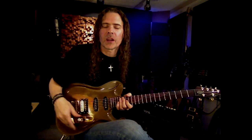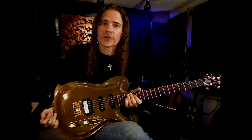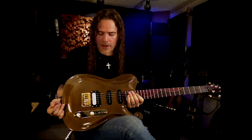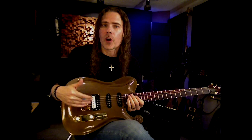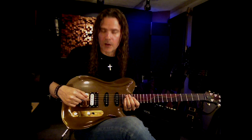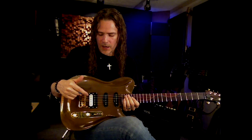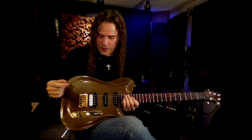If you want to live with that noise, okay, maybe that's a good trade-off. You have to make sure you're always shutting your pickup off right away, and that you're not too close to the lights and all that kind of business. Now, shields help a little bit. What we've got here is graphite shielding, and the cool thing about it is that you get all the benefit of shielding without the drawback. The drawback isn't there because it's an organic compound and it's magnetically neutral in terms of the magnetics of the pickup. As a result, it allows you to get a level of protection from noise without screwing your tone at all.